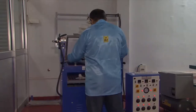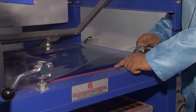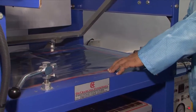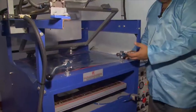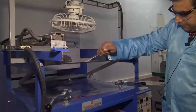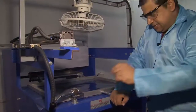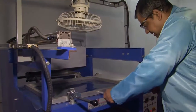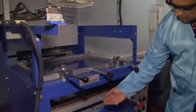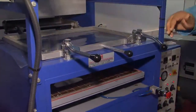We place this sheet in the correct position. You can see a rubber packing which creates a good seal between the plastic sheet and the metal body. The idea is that this region is vacuum-pulled, so we need the vacuum not to leak. There is a rubber seal for that purpose, and also a clamp which goes all the way down to grab the sheet over the rubber packing, fitting the sheet tightly over the top of the system. As the table rises with the workpiece, there will be proper sealing of the vacuum between the table and the top portion of the plastic sheet.